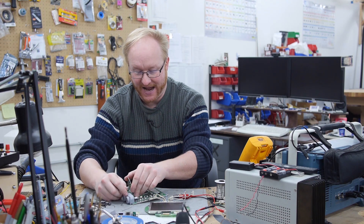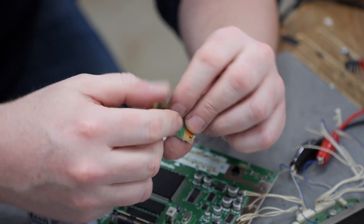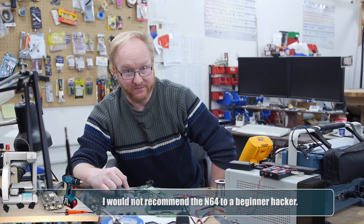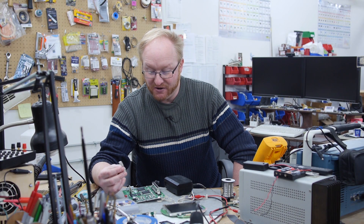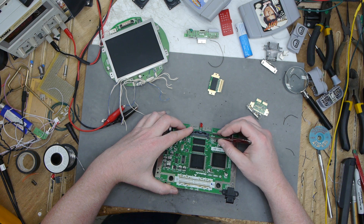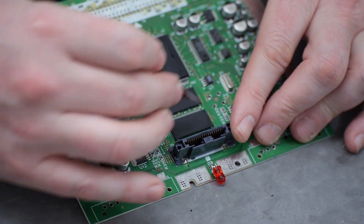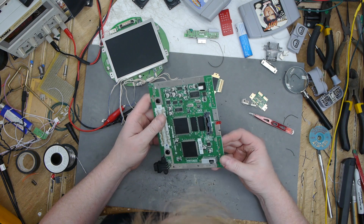What people have done is take these packs, cut a slit in them, and then bend them over, leaving the copper traces intact on one side and making it basically parallel. I mean, rewiring this seems to be a bridge too far — but we actually got two more RAM expansion packs, so we have plenty of chances to screw this up. I've desoldered the metal shroud from the RAM expansion; all we have left is the plastic. If we removed these feet, I wonder if we could just bend it forward — it might work, or it could break.